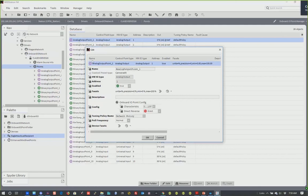Looking at analog outputs: you get 0 to 10V and 2 to 10V, and you set up direct or reverse acting. There is no milliamp output — strictly voltage. The analog output can go 0 to 11 volts, 1 milliamp max. That comes into play with pneumatic actuation and I-to-P transducers — a 1 milliamp type transducer needs a three-wire version with separate power. Some controllers offered 10 or 20 milliamps, but here it's only 1 milliamp.